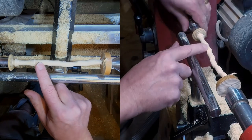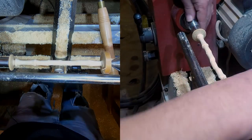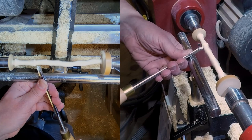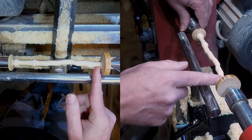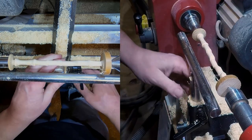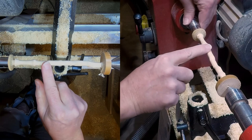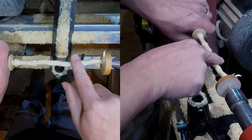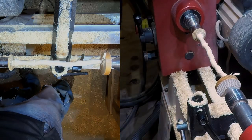I just need to take that back a little bit, so I'm just going to put this off center again, then back to center again. Now before I just define more of the parting off points, this is now effectively finished as far as I'm going to go. I need to now just sand this all up so that I take out all these sharp edges, and hopefully you can see that the gentle movement on there has created more of a stick shape, especially once we get rid of these edges.